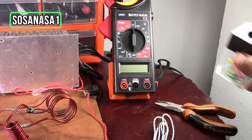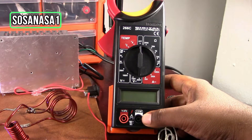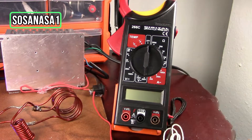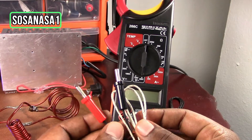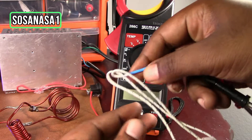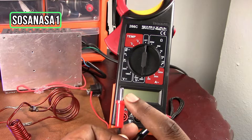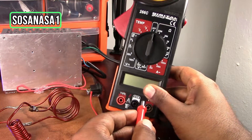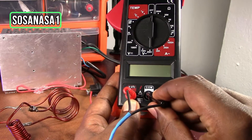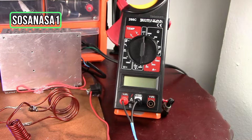For doing this test, we are going to use this clip. In this box I have several clips. Let's move this closer to watch better. The digital multimeter is ready. The first step is to connect this thermocouple to the digital multimeter — this is very easy. The red tip connects with the red point on the multimeter, and the black connects here on the multimeter in COM. Now the thermocouple is connected to the digital multimeter.